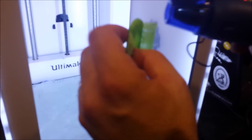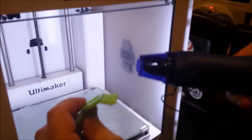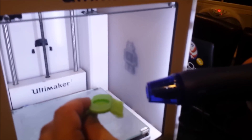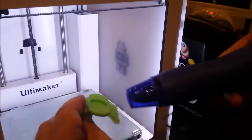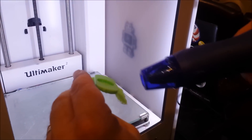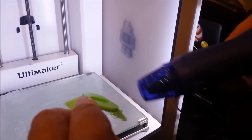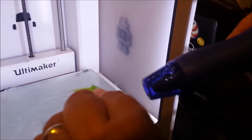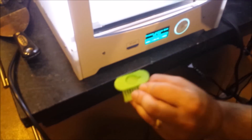This is how we form the bristles. I'm using a hot air gun here, and you could also probably just use a hair dryer on PLA — PLA is pretty soft at low temperatures. So just heat it up a little bit. You've got to be a little careful, don't heat up your fingers too much. Okay, it's starting to get soft. Now let's put it against the edge of the table and go straight down.